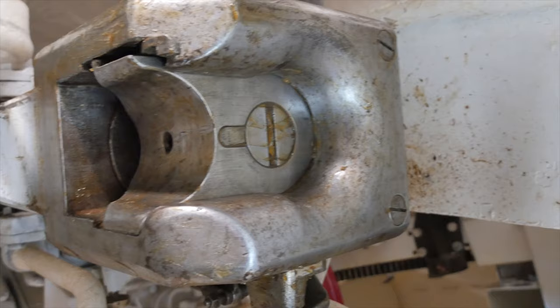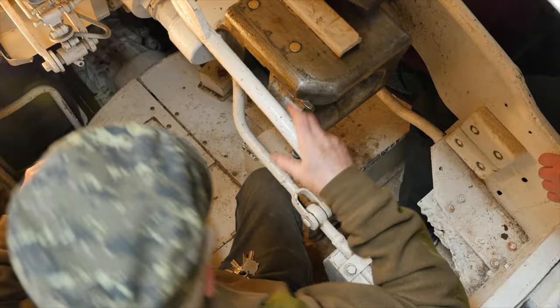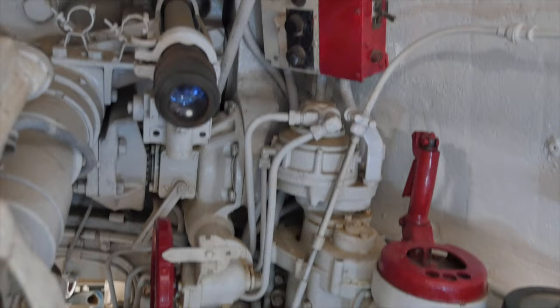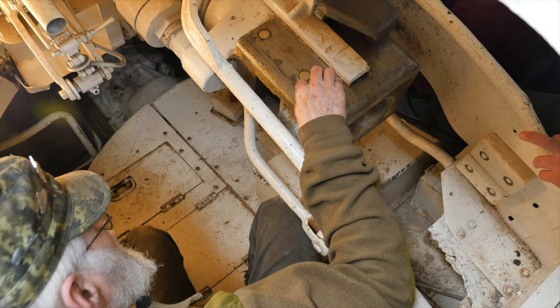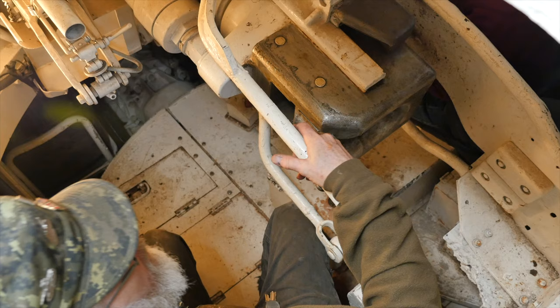And the next thing would be to fire. To fire, we've got two options with this one. We have full electric control, which is the big box up there to your right at the front, and down below here the two push buttons. The right-hand button is for the main gun, the left-hand button is for the coaxial .30, so that you can trace it onto your target. And just in case there's an electrical problem, there's a foot pedal up forward of that that allows you to fire the main cannon.